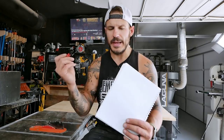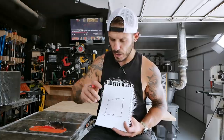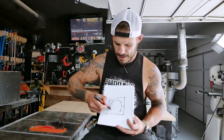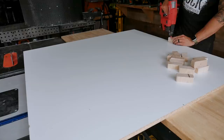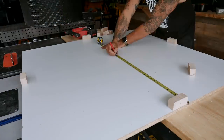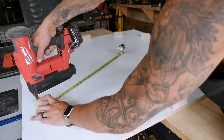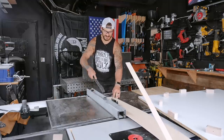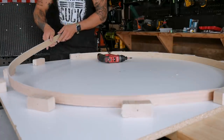Now let's figure out our concrete scenario. It's interesting because I've never done a circular pour — I've always done square or rectangle. Here's what I'm thinking: take a four-by-eight sheet of melamine, cut it in half to four-by-four. I'm going to place two-by-four blocks in a circular pattern and then fit and bend that plywood inside of it. It might work — I'm not sure, but let's try.